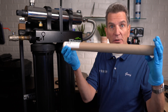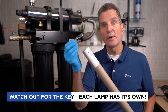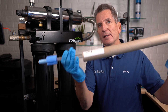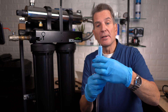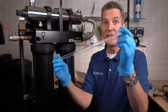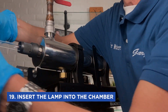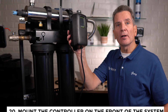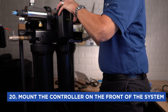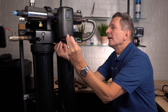When unpacking the UV lamp, again use rubber gloves and watch for the key — this key comes with every lamp and must be used with it. Carefully remove the lamp from the packaging. You can handle it by the ceramic ends with bare hands, but I suggest keeping the gloves on. Be very careful — these lamps are quite fragile. Slide the lamp into the chamber. Then mount the controller on the front of the system: thread the bolt through, slide it in, and add the nut. Bolts and nuts come with the system, one for the top and one for the bottom. Tighten it up.